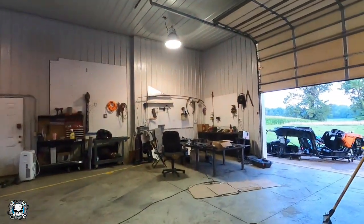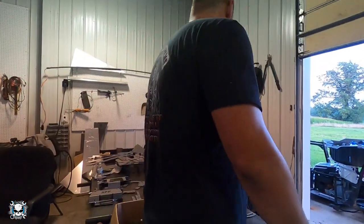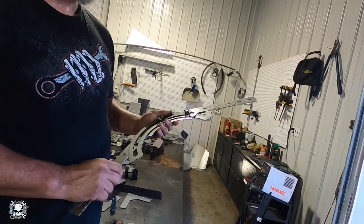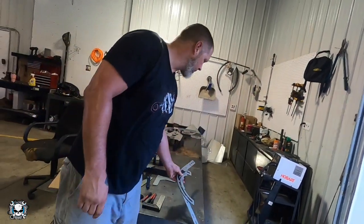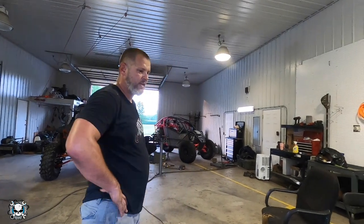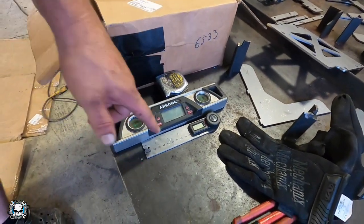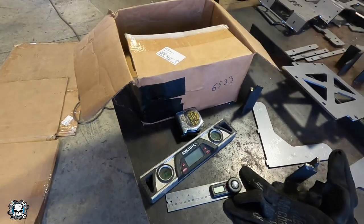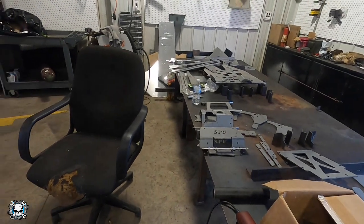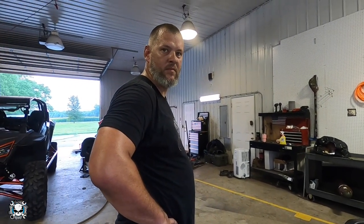That's really it to go with your bender. The Vindicator protractor, you've got to get it the same radius as your die. It helps you figure out angles, helps you see where you're going with your shapes. But other than that, just a simple square, tape measure, little angle finder, little digital level, some grinders, cutoff wheels. I mean, that's it. What would you say? Less than $800 to $1,000 maybe, and you've got all the tools you need.